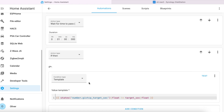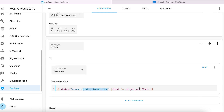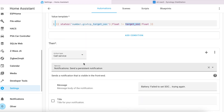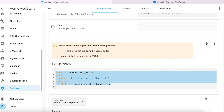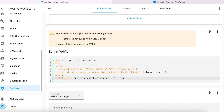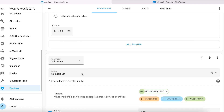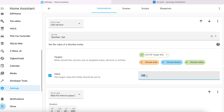I had a few issues with it not always applying, so this if statement compares the entity against the variable and if they don't match we try it again. I could improve on this by looping around it until it works, but trying twice appears to work fine for me. I then output that into a text string and save it to an input text helper to help with logging. Finally, I wait until 5am and set the state of charge back to 100%. This is just a fail-safe in case Home Assistant fails during the day — I don't want the state of charge value getting stuck on a low one for days at a time. I'll put all of the details and that automation up on my website with a link in the description below.